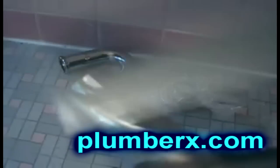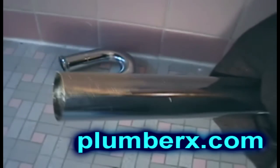What I like to do is kind of lay my material out before I get the job started. Here you can see that I'm scraping off the chrome part of the J-bend so we can get down to the brass, because the brass is where we're going to be able to solder the two pieces together — the lead and the brass pipe itself. We're just doing this with a regular file, just going to keep filing it down until we get it down to the brass part. You can see the chrome is gone.